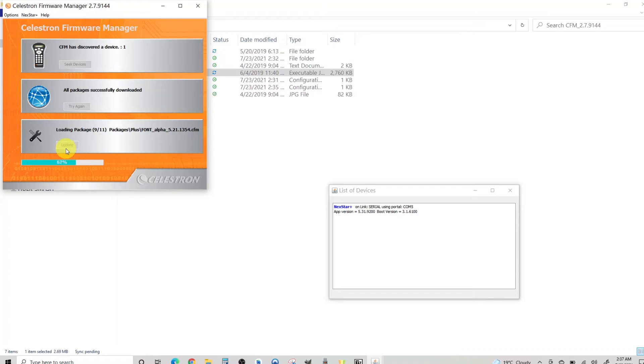This is a newer controller, so you will see a mini USB port at the bottom. However, if you purchased the telescope earlier, you might find an RS-232 port instead. The process is the same — just connect that RS-232 controller to your PC to start the detection and update process. Note that the mini USB to USB cable is not included with the purchase, so you will need to buy it separately from a third-party seller, online, or a local store. I purchased mine from Amazon and will put the link below. If you have an RS-232 port, please buy the appropriate RS-232 cable.